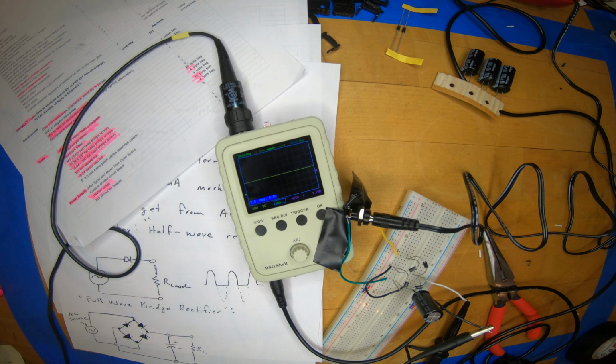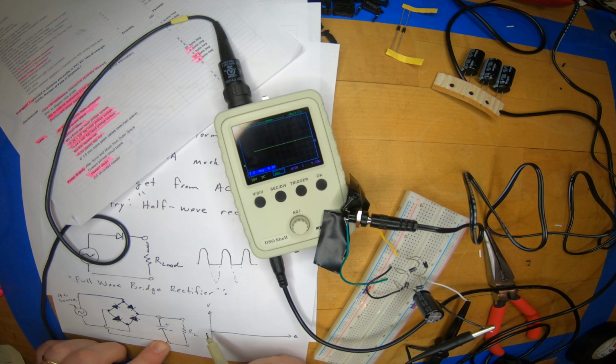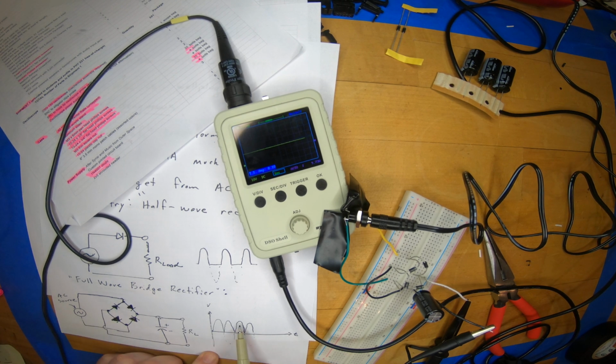Again, how does it work in my head? What I think of is that the full-wave bridge rectifier, again, to sort of plot what's going on, voltage versus time, and think, okay, it's doing this, right? Originally, of course, the circuit had looked like this. But we've rectified that away and flipped these up on top by our configuration of diodes. So this is what we have.